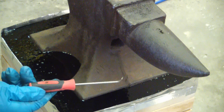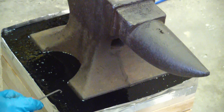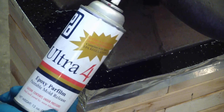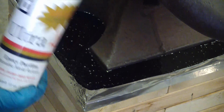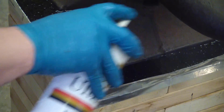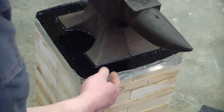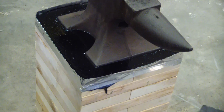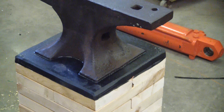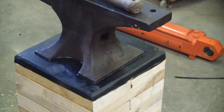While we've got the little one in a good mood, you're going to want to grab your $200 Snap-on O-ring pick and go ahead and pop all the little bubbles. I recall a little trick for getting rid of surface bubbles is spraying mold release on there, so we're going to give it a try. It's starting to stiffen up, so I think I'm just going to have to live with the bubbles. Today is tomorrow and the urethane's all set up — it's skookum as anything. Industrial rubber — it'll last you a lifetime in the shop.